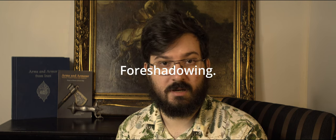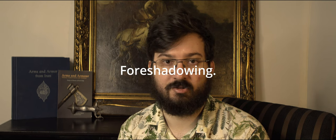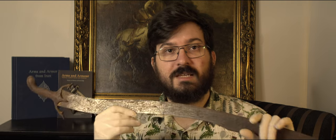There are alternative things I could use in a hydrogel to restore this sword. One of the things mentioned in a recent article is the use of oxalic acid in a hydrogel, something I've explored before for using on pattern-welded swords. But for this, we are just going to be using EDTA. The exact formulation won't precisely match either paper — they use 3% agar with 2% or 5% EDTA by weight, but I'm going to keep it even and just do 3% and 3%, somewhere in the middle of the range.